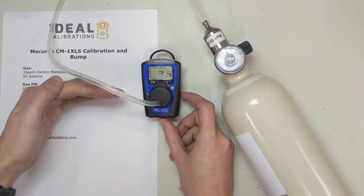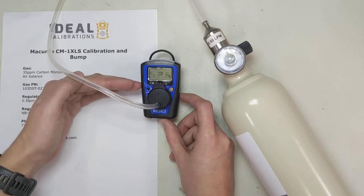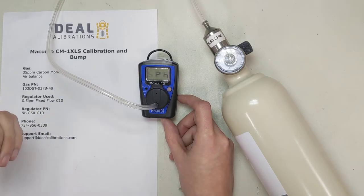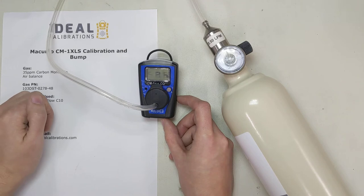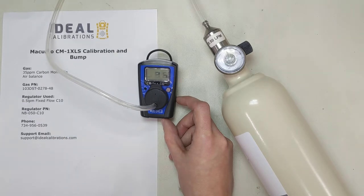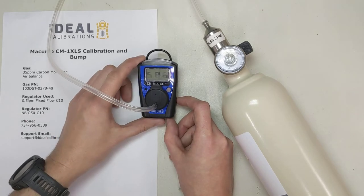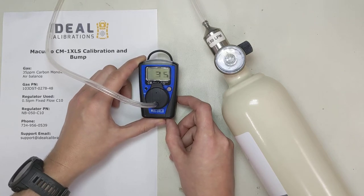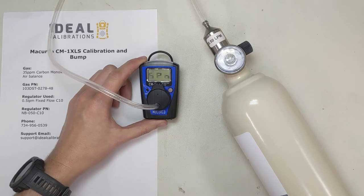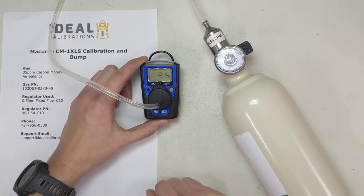What this is doing internally is reading the gas. It takes a little time for the sensor inside to get up to the full amount. They have what's called a T90 time in the industry — that's how long it's going to take until it recognizes 90% of the given value. You'll use it as a signifier of how fast your sensor reacts. Some OEMs brag about their T90 times; others have slow sensors, like chlorine dioxide with a T90 time of a minute. Usually you want to see T90 times like 15 to 20 seconds — as quickly as possible is always best.